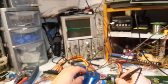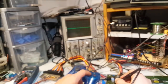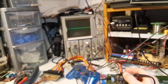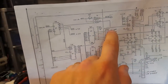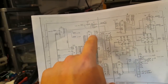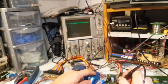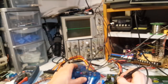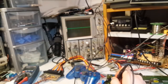So it's low, and it's low, and when we press the button, it should become high, and nothing is happening here. If we check with button 2, which is on pin 6, I'm just going to show you again. The loop button, which is where your plane goes over, but it's button 2, it goes on pin 6 and outputs on pin 7. If we look at pin 6, it's high all the time. We press the button, it goes low. In this case here, it's low all the time, and nothing really happens. When you press the button, it just goes even lower.